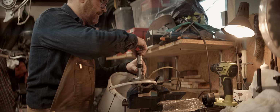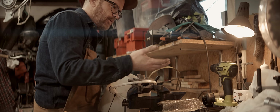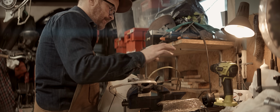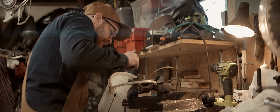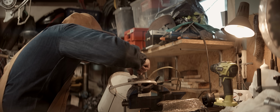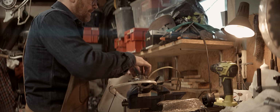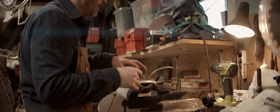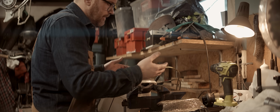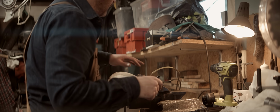It is currently sitting at 39.3 millimeters, which means there's lots of material to hone away. So it might be that honing is too slow, and we'll have to bore it out a little bit. But the surface finish is kind of rough, so when we get past that and the surface has become smooth, it might be relatively larger than what it's measuring at the moment.